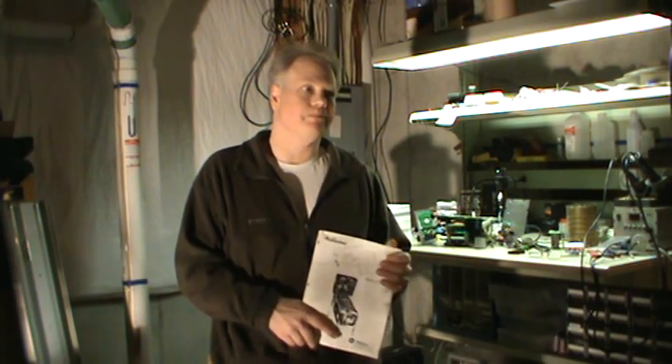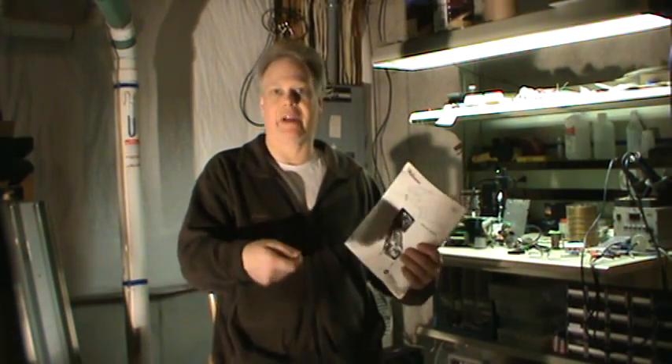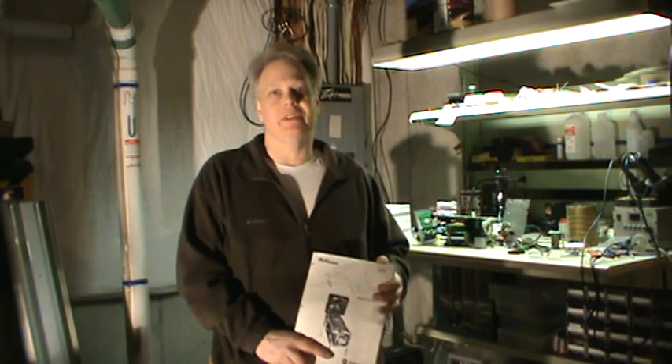There's been an annoying 60-cycle hum that I've been trying to get rid of for quite a while. I went to Great Plains, got a cap kit, changed some caps — that didn't help. Then I ordered the wrong cap kit. I put feelers out on RGP about grounding issues and tried a bunch of different things, like alligator clipping ground wires to different places. But today I pulled out the scope and fixed it — really easily, unbelievably easily. I'm going to show you guys that right now.